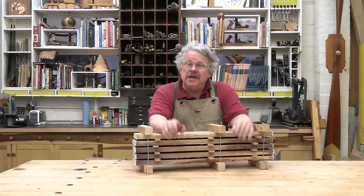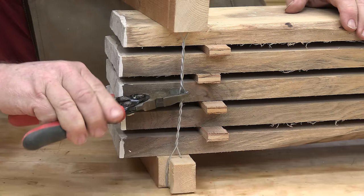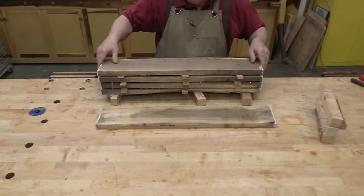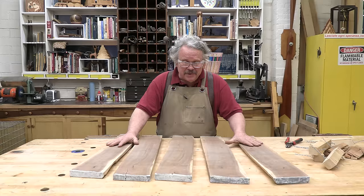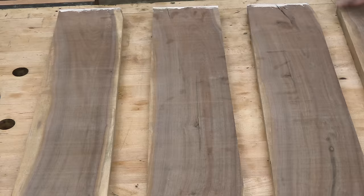So it's obviously time to clip these wires and see what we've got. After a year, all the boards are straight and true — no bad cups or twists. We did find that this wood shrunk considerably; even the thickness is down by about a sixteenth to an eighth of an inch. But there is 4.2 board feet of usable walnut here. Not bad for a piece of firewood.